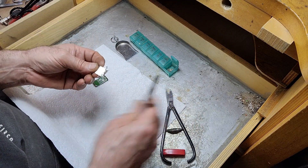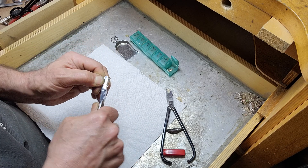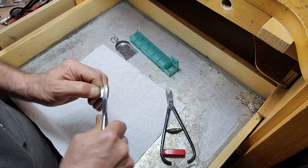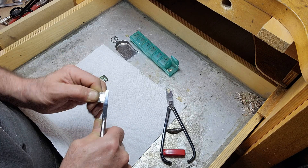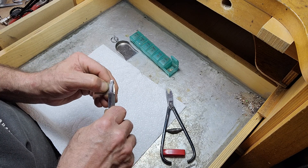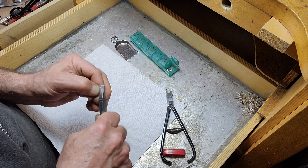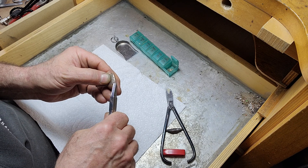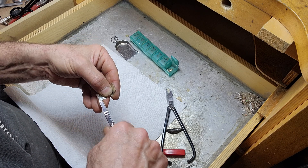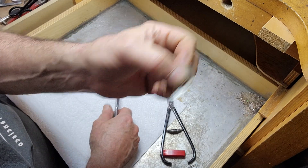Take our pair of duck bills here and just slide from the point where you stopped your cut, and pull them through under a little bit of pressure. Flip it over and go from the other side. You can bend just a little bit as you go along to take some of that curl out and get them all trained back up. The ones on the ends always seem to want to curl the least, so you'll probably have to do those individually. Get them into a cone shape like such.